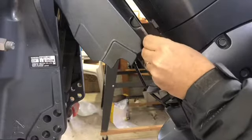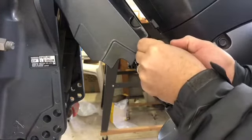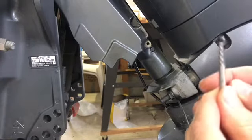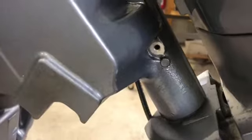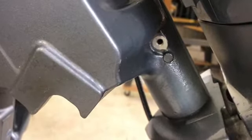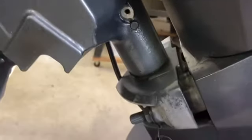I think what happened is exactly what we hoped - we have a fitting that's bathed in grease versus corrosion on a fresh water engine. Here are the remains of the fitting, backed out perfectly. Excellent - thanks Stu! We've got our clean threads there, hopefully not damaged - I don't think they are. I'll order a new fitting which will make it in time for spring. This wire gets pinned in by the new grease fitting - I'm assuming that's a grounding line, perhaps for the sacrificial anodes.